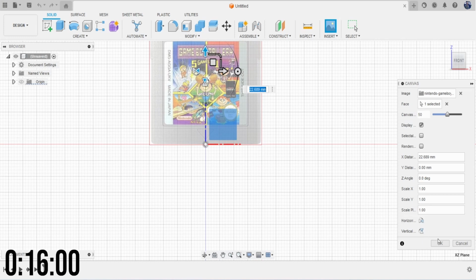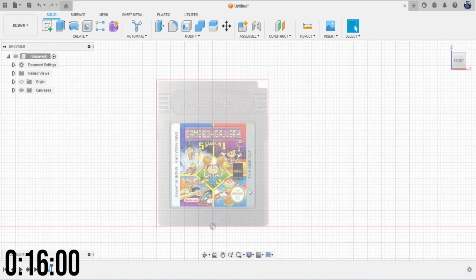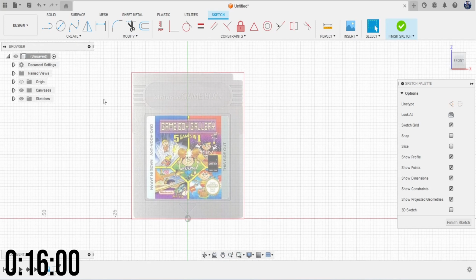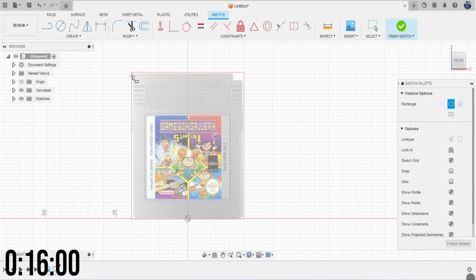up like that. So just looking at it quickly, it's got mostly symmetry. The only thing that it's not got on both sides is this little cut, so what we'll do is we'll do half of it, mirror over, and then we'll do this little cut later. So what we're going to do is create a sketch, and to begin with let's do half a rectangle like that,